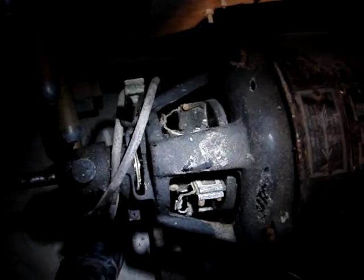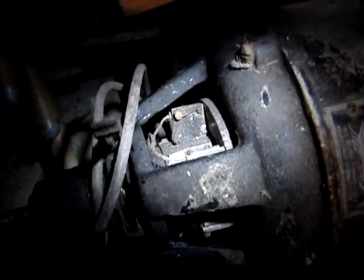This is a Spencer turbine. This puts out five inches of pressure. It's got a two-foot fan in it — two of them. It's supposed to have a three-quarter horsepower motor, and that's what it's got. It's a very old brush-style motor. When the thing fires up, those brushes snap out and put it into high speed.